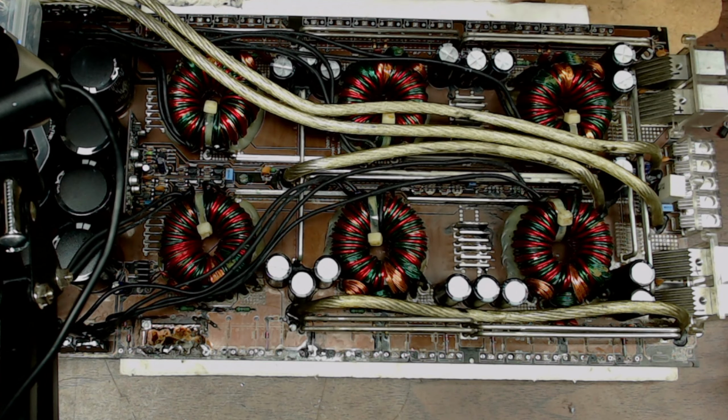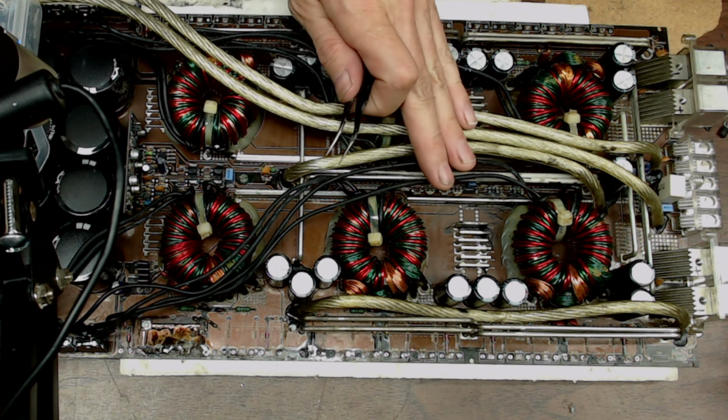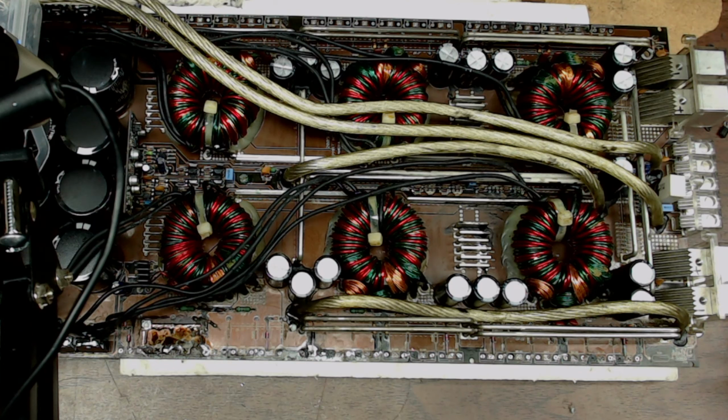And so that's pretty much where I'm at on this. I'm hoping to have the power supply done today. I gotta pull all the output transistors and replace the IR2184 on the output drive card. I just replace them all. I don't even mess around, just replace them, because there is a bank of failed output transistors.